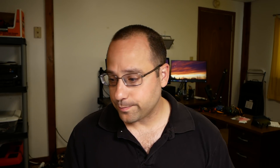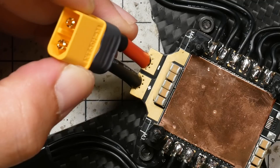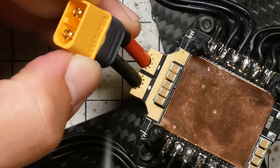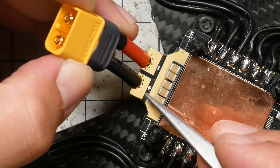Now if you're sitting there and your wire is just not taking the solder, then something isn't right — heat's not getting into the wire. When everything's working right, the wire will get hot and the wire itself will melt and suck the solder in. And if that's not happening for you, you may want to figure out what's up with your soldering situation, because the next joint we're going to do is the one that is going to demand the most of your setup — and that is this main XT60 lead. We're going to solder the wires in sideways. Plus, minus — red is plus, black is minus, and I got them backwards.